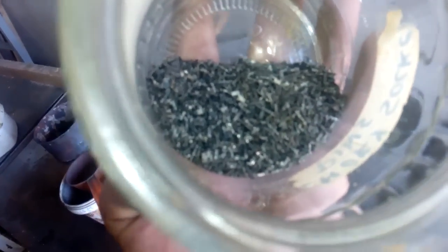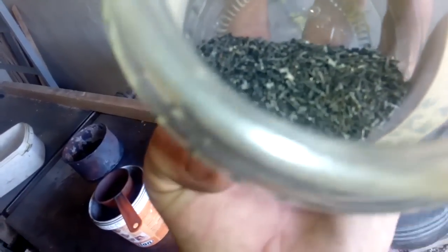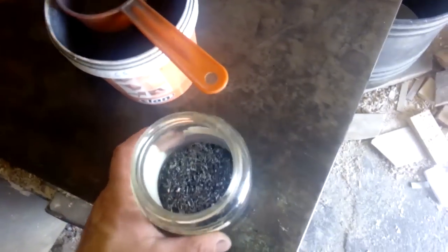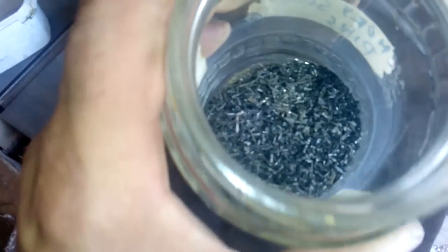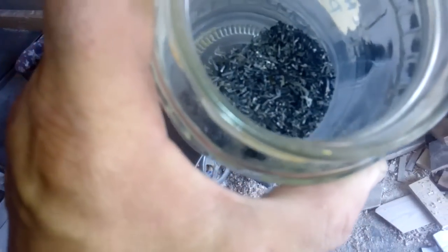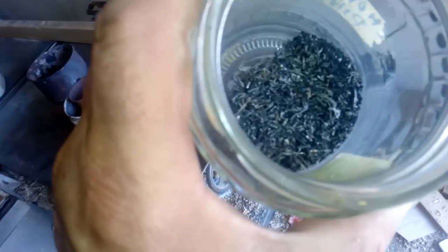Okay, we're finished. What we're left with here is mostly burned pins. Not much, but now you could put that in the AP solution - wait three days, because only three days is enough since burned metal dissolves much easier than regular pins. Then you could do some nitric acid, but nitric is expensive, or you can do straight aqua regia, but there's too much base metal here. So what I want to do is put that in the AP solution.